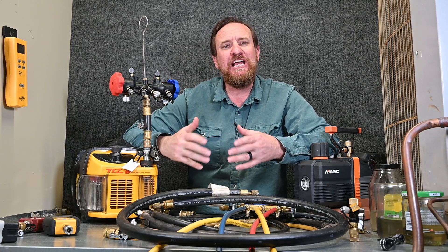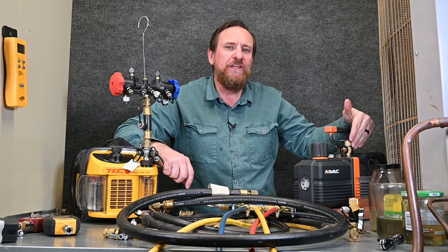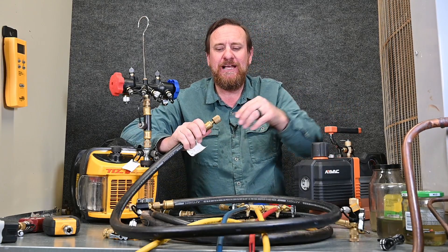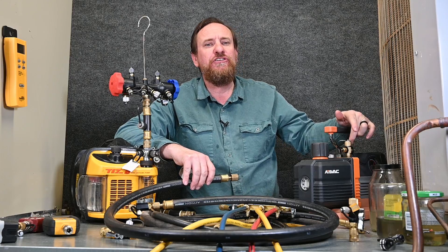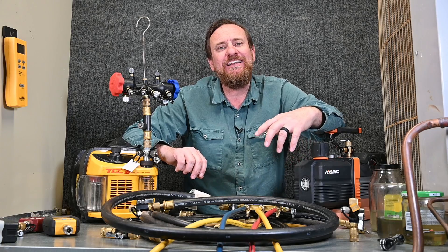You don't have to spend a lot of money on manifold equipment — you can make your own. Get it at your local hardware store: just two connections put right on your vacuum pump to make a tee. I also recommend using a product called Nylog. Nylog helps seal between connections so we're not pulling atmospheric pressure in. A lot of people complain the vacuum's not holding, and really it's the connection — sometimes little O-rings get cracked or worn, and Nylog keeps those lubricated. It makes a good seal on all your fittings and helps make your vacuum nice and dry and tight.